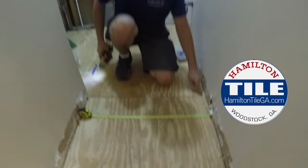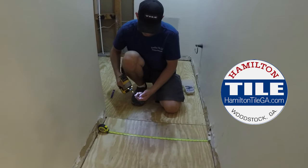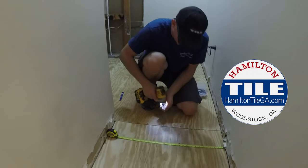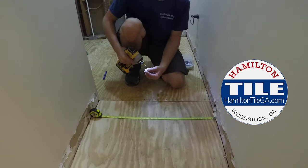Since these are six inches and the requirement is four for an edge, I just put one in between — it's three inches on center — so therefore you go above and beyond the minimum requirements, which I always like. Everything's nice and straight and professional looking. For all you do-it-yourselfers out there that want a more professional job, utilize this tip and when somebody checks out your work, you'll look like a real pro.